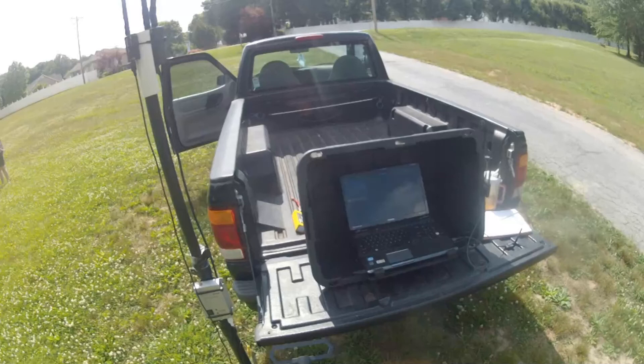That notebook is running Mission Planner. I've got the truck turned into the sun so that I'm shaded, but even kneeling down with the box blocking the sun, I can't see the screen. Before I flew, I knew this thing's not calling out my modes to me — it's not reflecting my modes. It's connected to the platform and the video is being recorded, but when I change modes on my radio, I don't hear or see the modes reflected in Mission Planner.